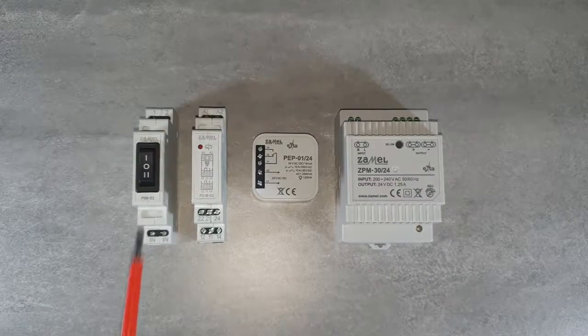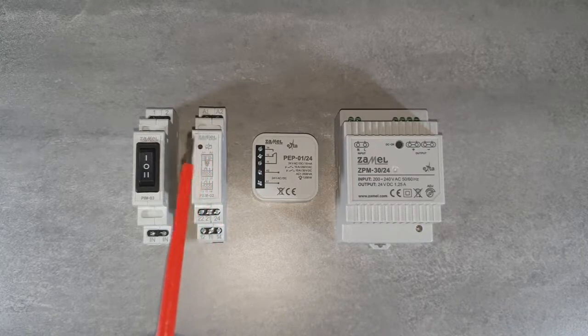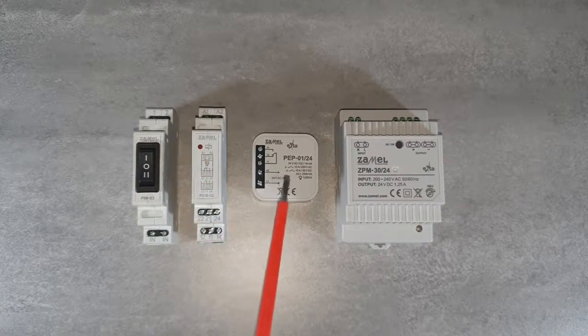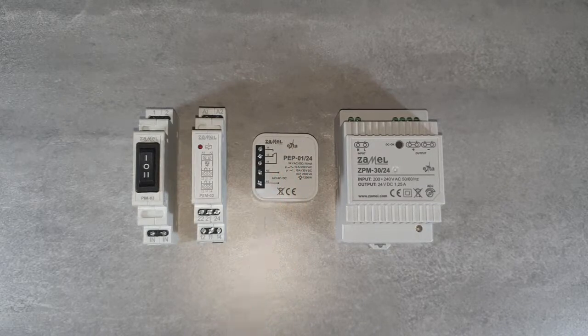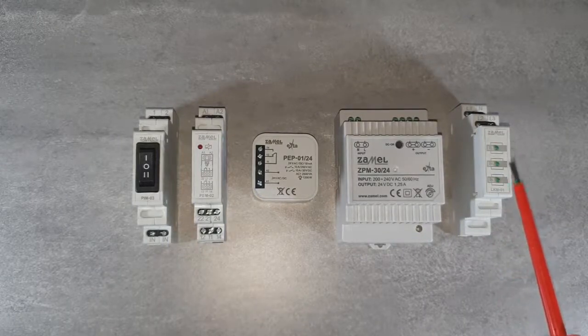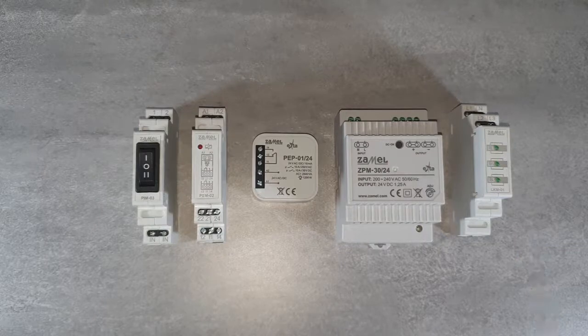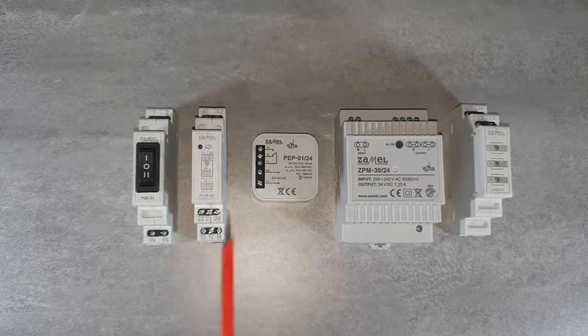The double circuit switch PIM03 allows selecting the powered circuit. It can be used as a selector of automatic and manual mode, direction of motor rotation control, or as in this example, the PIM03 device switches two circuits. In order to show the relay operation, the LKM01 power indicator will be used to display the status of the installation. The device has several color versions of LEDs.